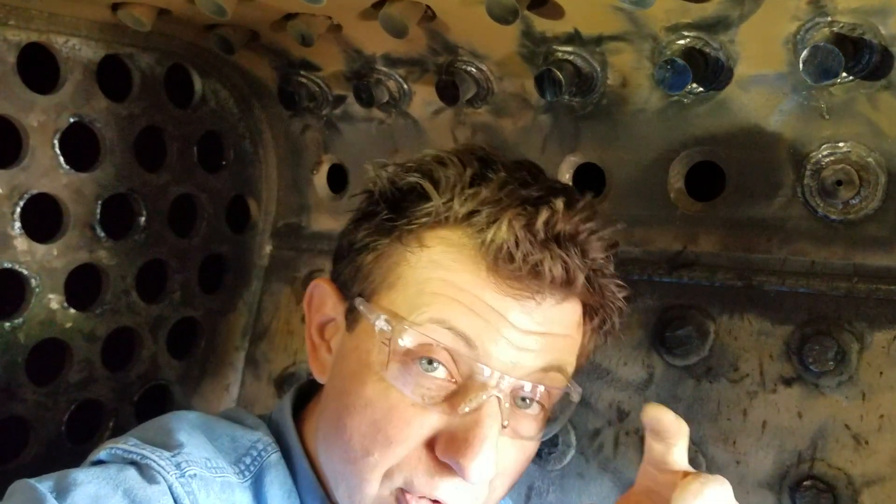I've seen this done before. Like the Grand Canyon Railway under Robert Franzen's direction — the 4960 received new side sheets back in the 90s with full penetration welded bolts. They're beautiful. The root pass was done with a TIG welder, and there's a perfect little bubble of weld around them. Continental Fabricators out of St. Louis, Missouri, they've built several new boilers — they do the proper angle chamfer of the joint before welding it out. And you can tell by looking at a boiler when people have kind of skimped, when the weld just seems really small around the bolt — it's just like a little bubble.